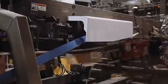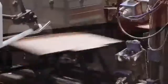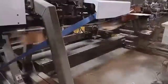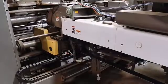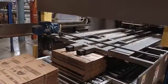On a flexo machine, glue is applied in preparation for folding. After the glue is applied, boxes are carried through a folding section with vacuum-assisted belts and a series of folding rods, forcing the panels to fold in the proper sequence. The folded box is now glued and joined as it exits the machine and is stacked into bundles to the customer's specifications. Added compression time is given to allow the glue to fully cure.